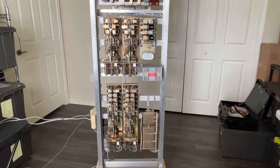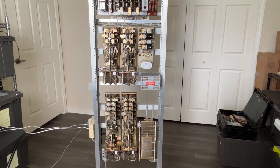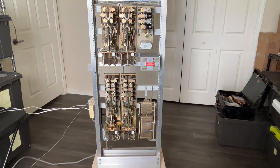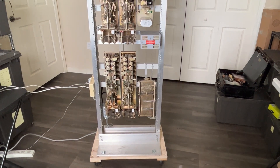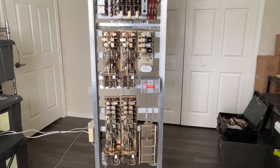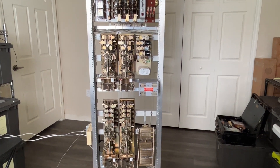There's an automatic electric dial tone generator mounted below the control unit that handles the trunk for incoming calls and some of the common equipment. Down at the very bottom are the two connectors. Of course, this is a two-link system and it is a four-digit system, so one-digit absorbing, then one-digit at the selector, and two-digits at the connector.